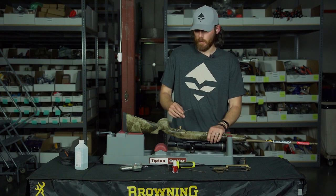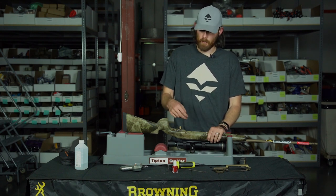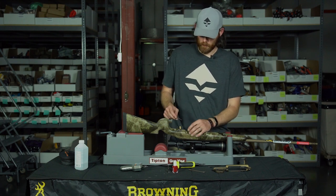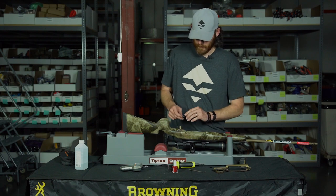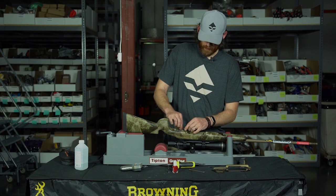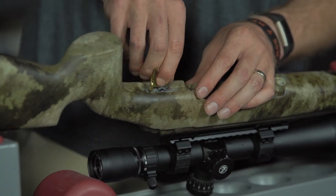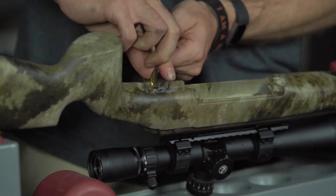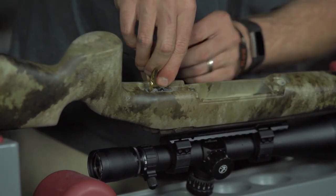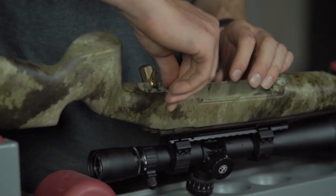Once I've removed all the nail polish with this little tack, I can stick an Allen wrench in there. Clockwise will make the trigger harder to pull; counterclockwise will make the trigger lighter. Right now since we were a little over four pounds, I'm going to go counterclockwise to make this a lighter trigger. One thing I like to do first on any trigger is tighten it all the way down and then go all the way back up, just to give a good starting spot. As you can see, it was pretty close to being all the way down.